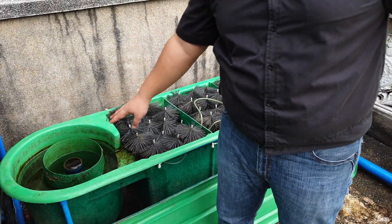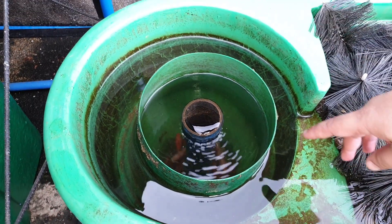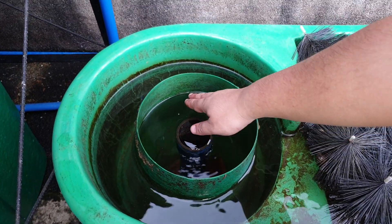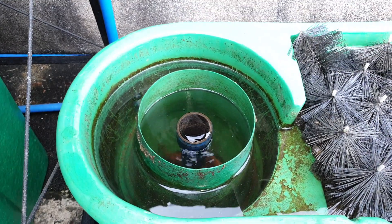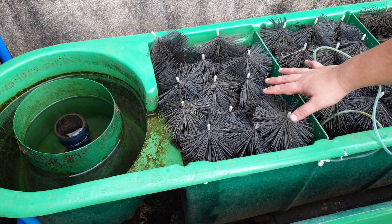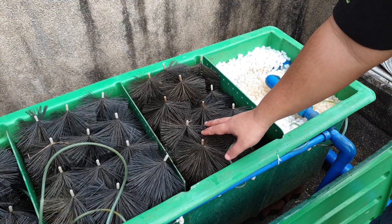From the fish tank it goes to a radial filter. We have some fish trapped at the bottom — we'll just place them back in the fish tank. The radial part of the filter has an inner cone that prevents sludge from exiting and diverts it below to a conical bottom, with a drain on the other side. Sludge that did not settle goes to the second stage, which is the brush stage, followed by a third and fourth brush stage.